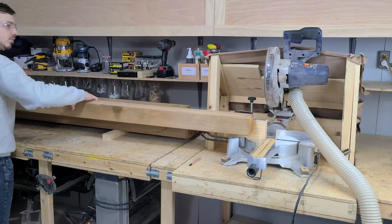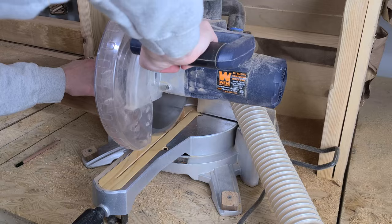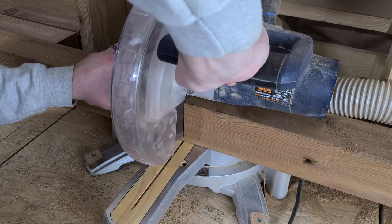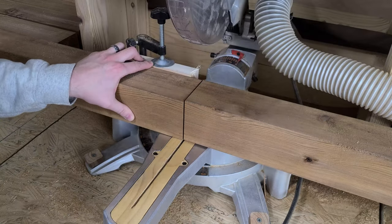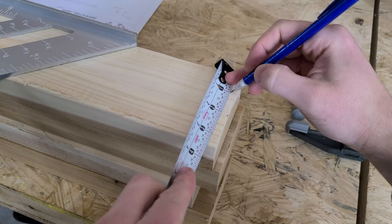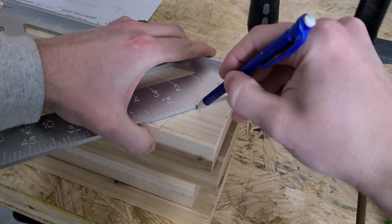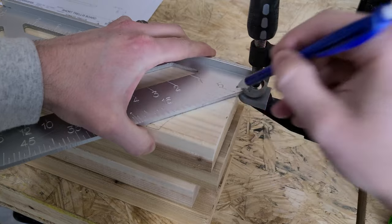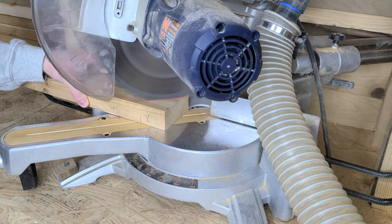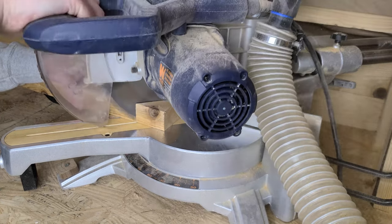Make sure that you are trimming off both ends so that you have a good cut edge on both sides of the boards. When cutting the posts, we have to install a block between the post and the miter saw's fence. With as thick as the posts are, our blade isn't able to get all the way through the board at the end of its stroke. This block pushes the post further forward and lets us utilize more of the blade. Once all of the boards are cut to length, we add our aesthetic chamfers to the ends. We turn the miter saw to 45 degrees and lock it down. These cuts are just decorative and don't have to be exact, so we can just mark each cut using our trusty speed square, then bring them over to the miter saw, line up the blade with the mark, and make the cut.